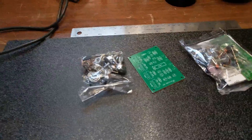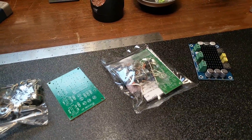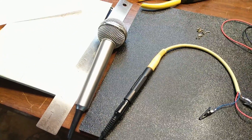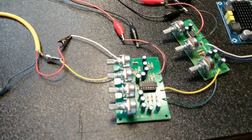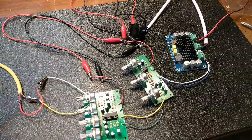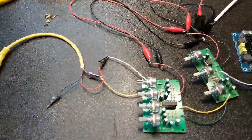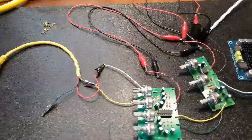For that end, I picked up a cheap eBay 4-channel mixer, a master treble bass volume unit, and a 100-watt amplifier board. I then wired up everything for testing — microphone into the mixer preamp board, then into the master volume and treble bass control board, and lastly into the power amplifier. All of the boards run on 12-volt power, so I hooked everything up to that and tested it out, and at this point everything seemed promising.